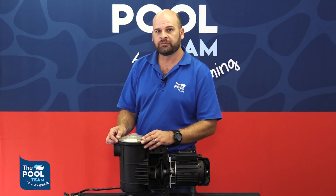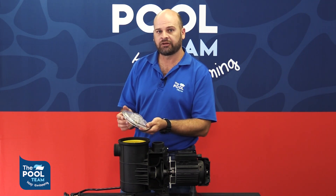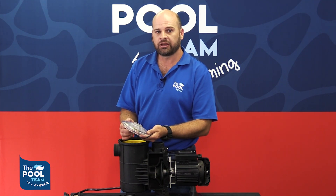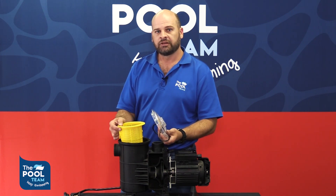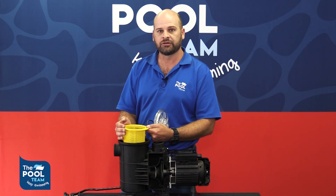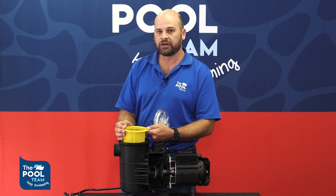Let's talk about a few parts that can be replaced by yourself. The pump lid and o-ring — if they have hairline cracks in them, they will suck in air and that will cause your pool cleaner not to work properly and can also burn out your motor. On the pump basket, if there are leaves in there and there is a crack in it, the leaves can go through into your impeller which will also affect the working of your pool cleaner, and your motor can run dry and burn out.